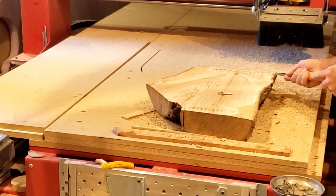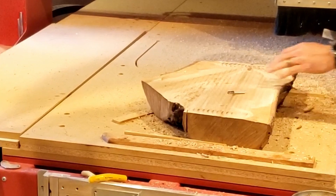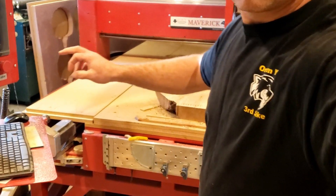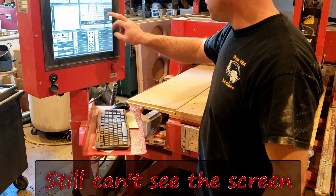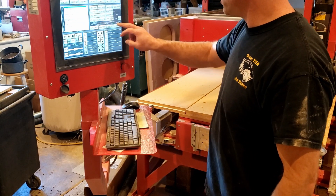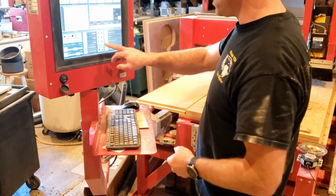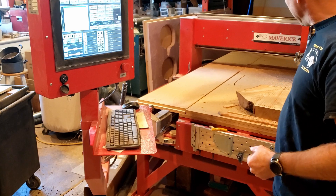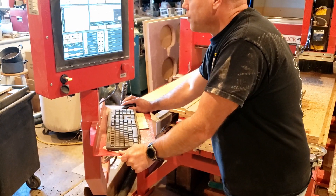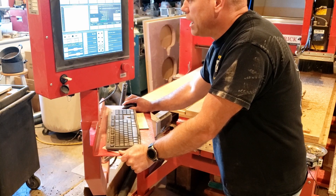I saw that corner while it was cutting, but what I didn't see was this lip right here. I still need to go deeper because of this and that. For my Z, I'm going to execute MDI, clear, Z minus 0.2, enter, execute. Now it's moved down there, I'll reset my zero and bring it up. I always make sure to lift my Z up to get it clear of the product. Then pull the updated program off the USB thumb drive and we're good to go.